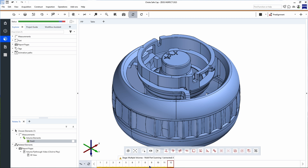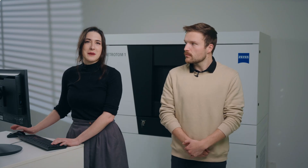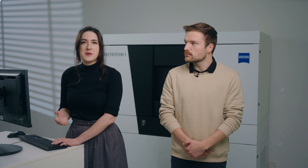Whatever is done to the first stage will be copied across all consecutive stages after that. In summary, when scanning multiple plastic parts, the only additional steps are fixturing the additional parts appropriately and automatically separating the volume with a simple separation tool built into the software. The best part — automatic volume separation capability — comes standard with the Metrotom 1.